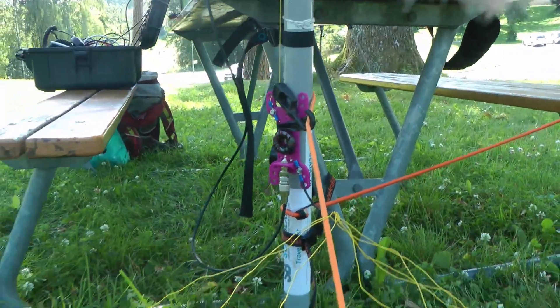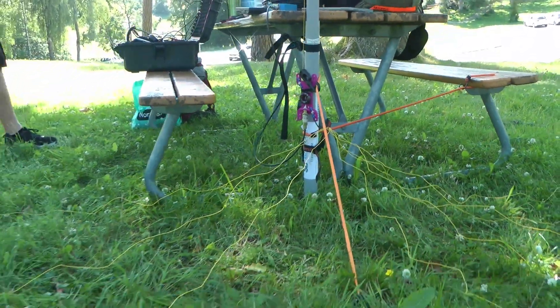So the multi-banded thing is the first thing that is good with this antenna. The second good thing is that it's compact. It's a vertical antenna. The ground or the radial net I use consists of eight 5-meter radials, which I can just lay out in a fan pattern depending on where I am — whether I go 360 degrees or just 180 degrees or 90 degrees. I don't see a lot of difference in how I deploy the radial net as long as I spread the radials out.